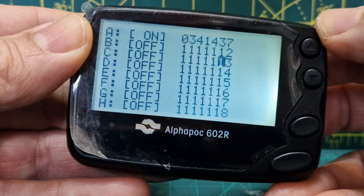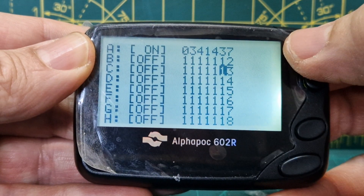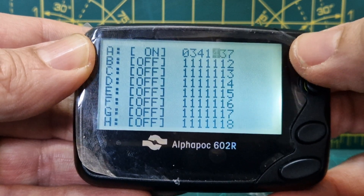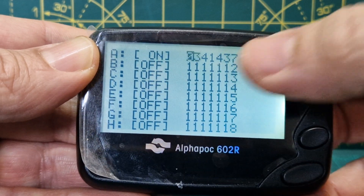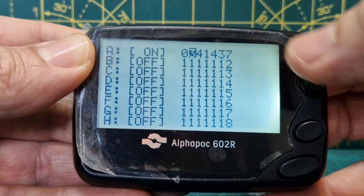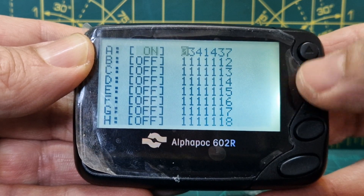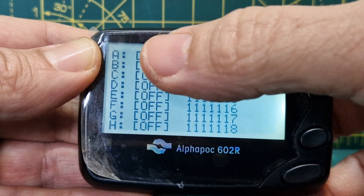You do have to register with DAPnet and open a ticket — I'll do a completely separate video on that. Right now we need to enter my DAPnet number, which was assigned to me. It's basically my DMR number, but with the leading digits replaced by a zero, making it a seven-digit number.